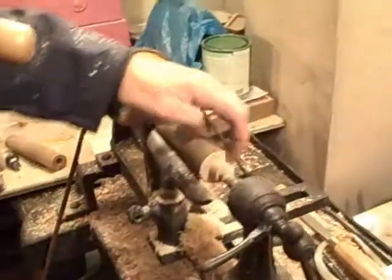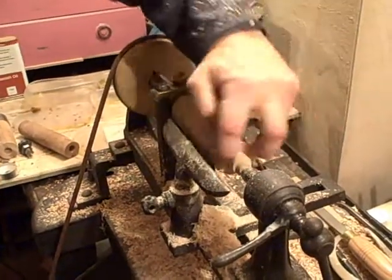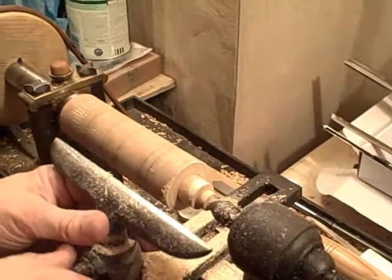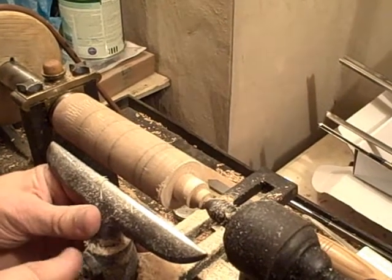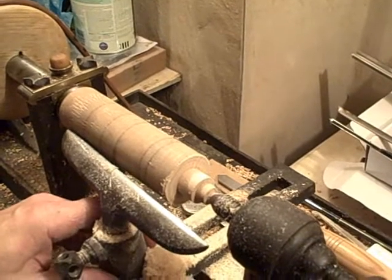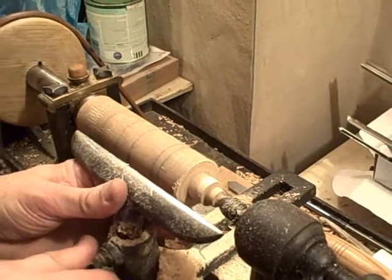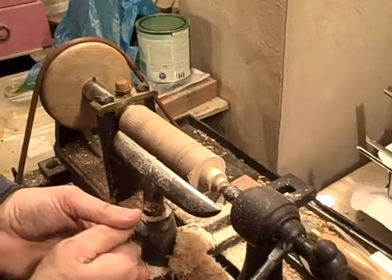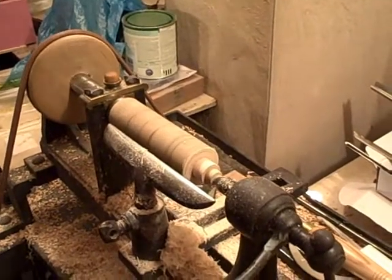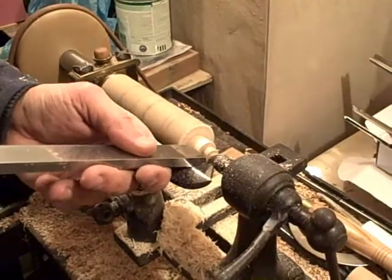We're still at 20mm. I could afford to lose another 2mm down there, so I'm about halfway down to that bung. And that's looking fairly smooth for me as well, so I think I might keep that rather than trying to skew that or anything. I'll live with that, bearing in mind that these are going to be dipped in linseed oil three times and then used on campaign. I don't think I'm going to need anything any smoother than that.